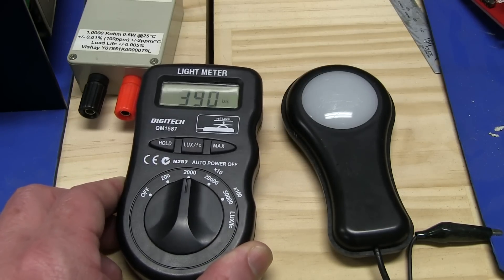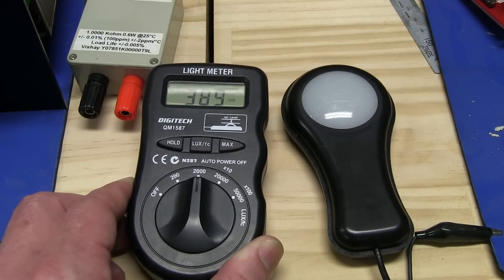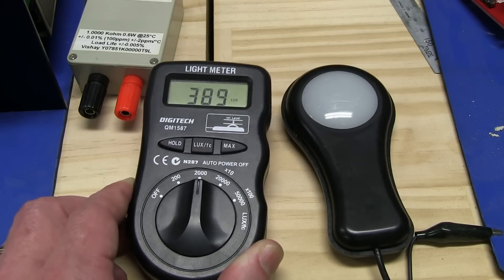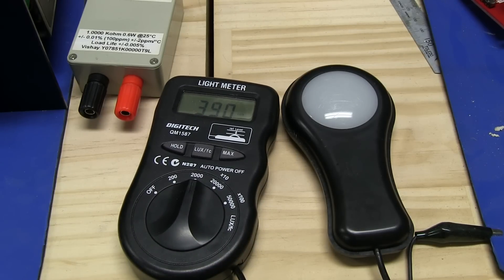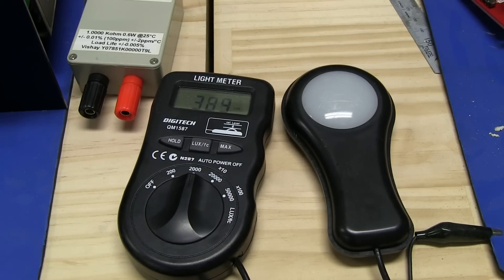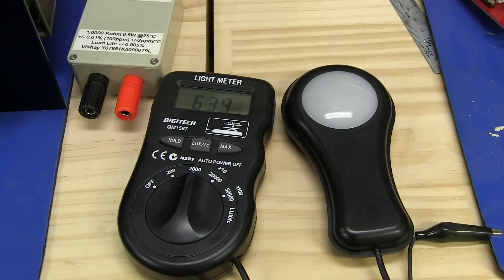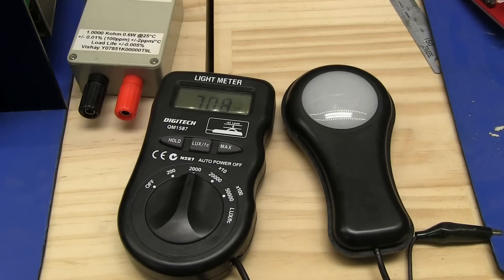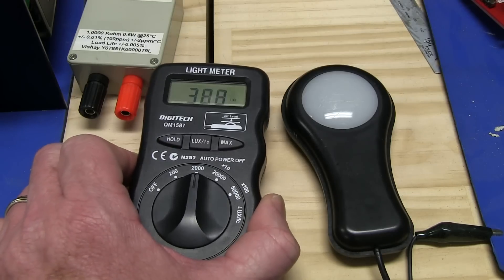The existing NEC quad phosphor tubes are 36 watts at 5,000K — basically top of the range fluorescent — and I'm getting about 390 lux here on the bench. I'll keep the meter in the exact same spot when I replace those two 36-watt ones with the two 18-watt LED 4,000K tubes. For reference, if I switch on my main LED panels it instantly goes up to 640 lux, and if I turn on the overhead strip lights as well it goes up to almost 950 lux.